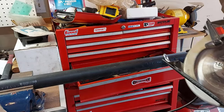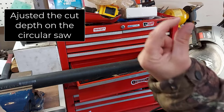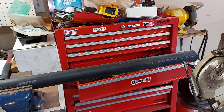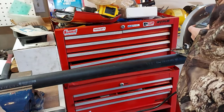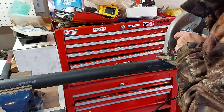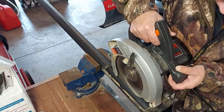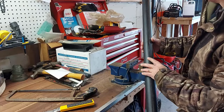The first thing I did was set my blade cut thickness very thin, because the ABS pipe is only that thick and you don't want to cut right through the middle of it. So I adjusted my circular saw for the cut. We're going to line this up the best we can and start cutting. There we go — a clean, pretty straight cut all the way through.